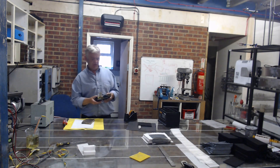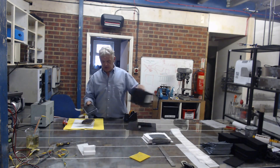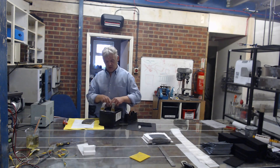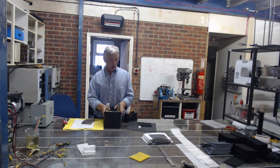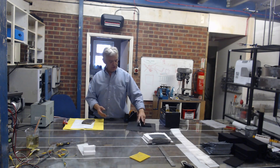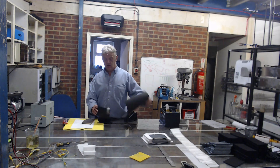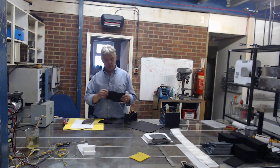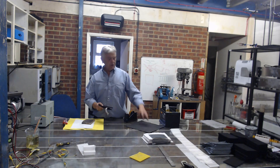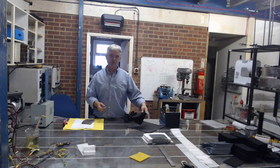So that's all you have to do to weld them together. You don't have a welder — I did mention that you could punch a hole and use a bolt — but that's ready to go in there. We just pop that in there, add the electrolyte, and that's the super capacitor ready to go. I'll be doing that next and doing lots of tests on that. So remember, the super capacitor is made just the same way as the battery — we use this plastic around some stainless steel to make these plates, this carbon felt, and you pop them either side and build yourself up some layers to what you want. Both of these things are on sale in the shop if you want to give this a go — I'll put a link in the description, and thank you very much for watching.